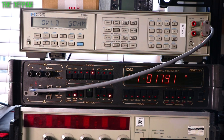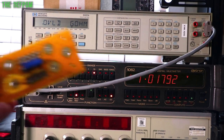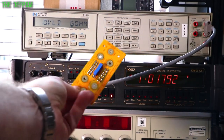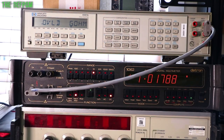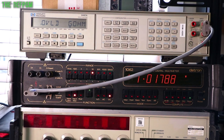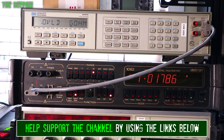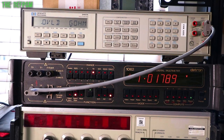I thought I'd show you a little demonstration, something I've wondered about for a while and actually thought I'd have a look into. Now, with this recent thing I've been doing with this board I'm making, resistor divider boards, these things, which are probably out of focus, the output of those is dependent upon the input resistance of the meter you plug it into. Now, that wasn't apparent, I didn't actually mention that in the videos I did previously. I probably should have done. The reading you get will depend upon what resistance the input terminals have.